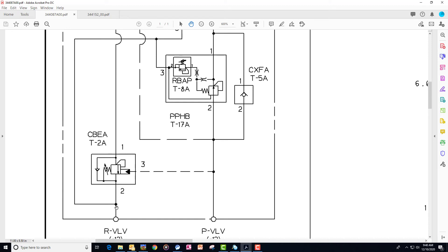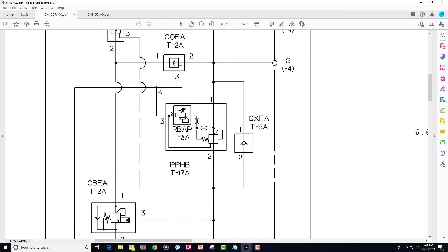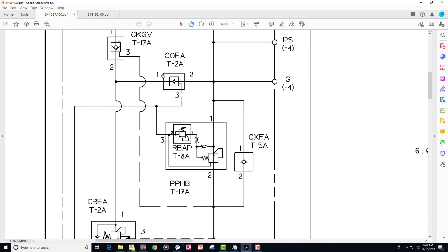This is on its way out back to the tractor and it has very low back pressure here. So this pilot operated check valve is here so that when we're raising the openers and that now becomes pressure, it would push the ball and make sure all of our oil goes to the rod end cylinders to raise them.